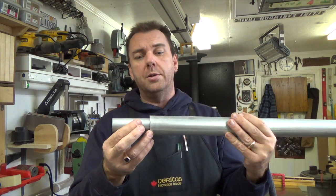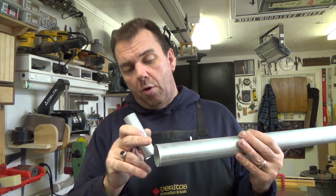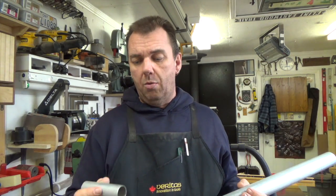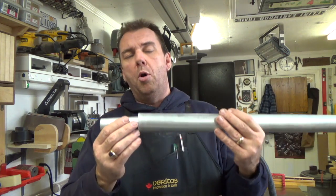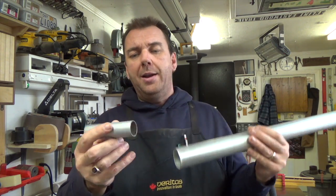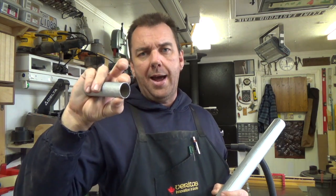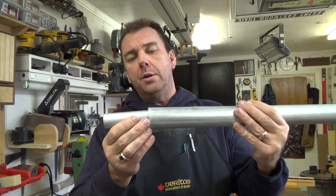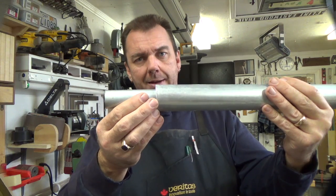to hold the nozzle. Now ideally I'd like to see a rod down here to hold this and weld it on there, but I don't have access to a welder. So I think what I'm going to end up doing here is bolting this in, and for that I'm going to drill and tap some 1/4 threads into two sides of this nozzle holder, and then I'm going to screw it or bolt it into the end here just like that.